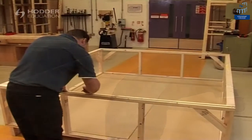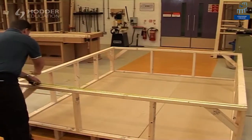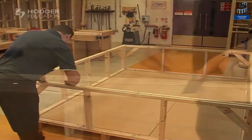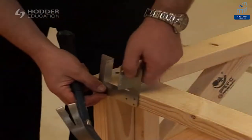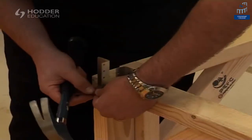Mark the positions of the truss rafters along the length of both wall plates. Ensure that the two outer trusses are 50mm away from the end of the gable. Marking just one side of the trusses rather than the centres will maintain accurate positioning and prevent the marking out being obscured whilst aligning their position on the wall plates.